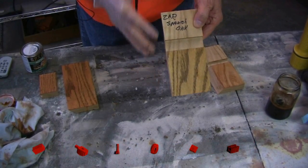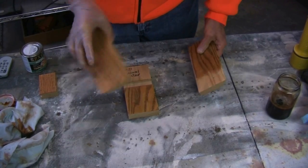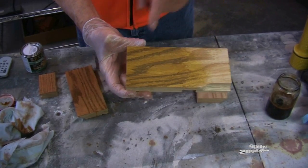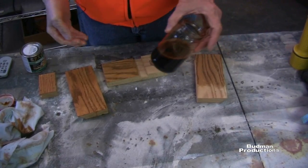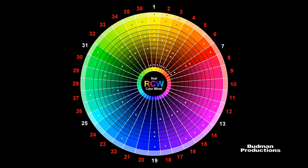When I put the stain on, it didn't look brown enough or red enough underneath it. So my first step was to mix up a yellow dye, and this is what the yellow dye piece looked like. You can actually see some of the yellow dye that I put on before I put the stain on. But this was way too yellow. So then what I decided to do was take and mix a batch of red dye and slowly mix it into the yellow until I came up with the base that I wanted. On this color wheel, I moved the color from number one down to about a four or a five by adding red dye into my already mixed yellow.